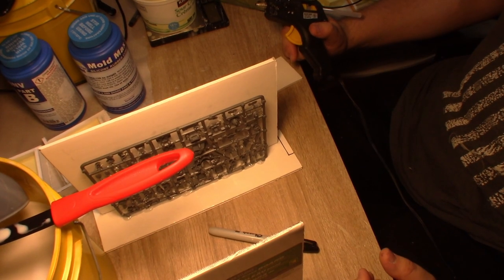Another awkward moment in the last attempt is that I had prepared the mold box pieces in this modular, easy to assemble way, but the way I had put it together was actually nothing but. I totally forgot to take advantage of the whole modular behavior of these panels and kind of glued them hastily in a, well, kind of a willy-nilly way, which is probably what contributed to the whole thing falling apart later on.